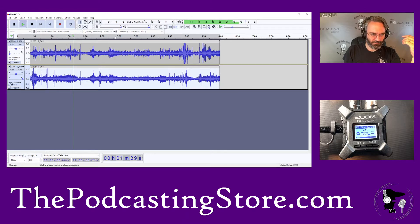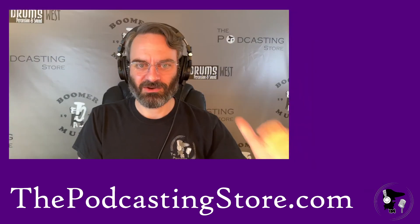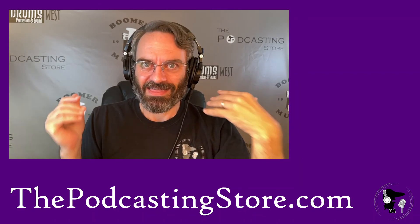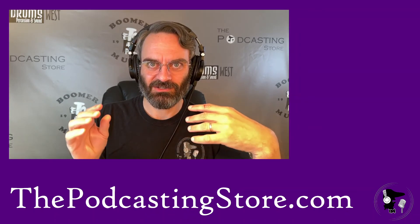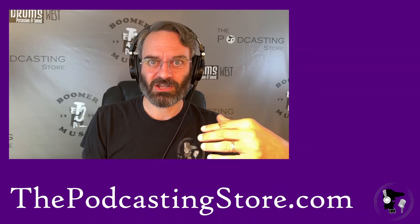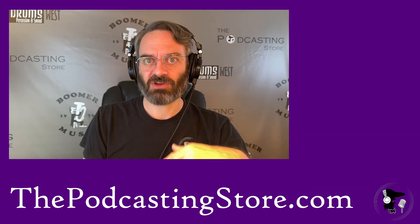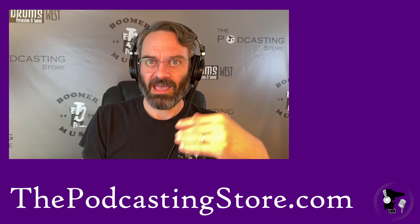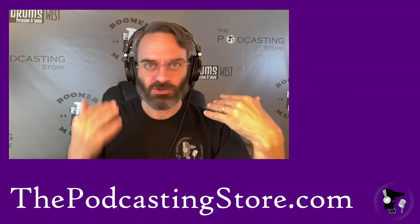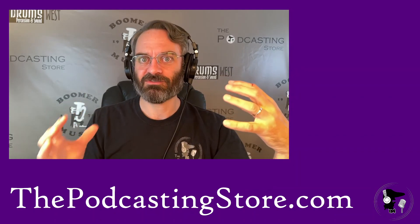You can see what I'm talking about — it was horrible recording conditions; we knew that from the beginning. That is our quick tutorial on how to use the Zoom F3 field recorder to do a stereo recording. My recommendation: if you want to do it in stereo, set it to stereo mode and record that way. You can always split the tracks in post and edit them independently — specifically with Audacity or Audition; there's lots of software that'll do that. Super simple to do, very effective in creating that depth of sound you're looking for.